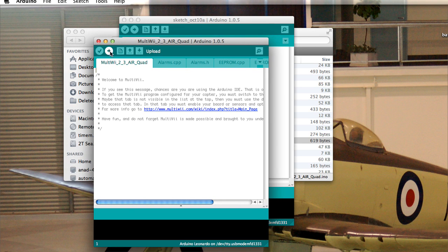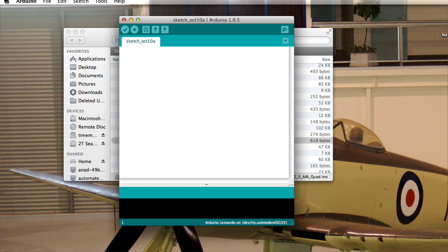Having cleared it 3 times, now I close that file, and now I go back to my air quad, click upload, and it compiles. Now it's uploading. If there's anything wrong with the sketch, you may get an error. And done uploading. Okay, so I've cleared the EEPROM, I've loaded a new sketch, and now I'm going to reopen the GUI.